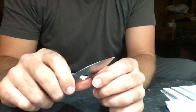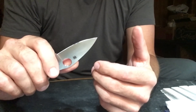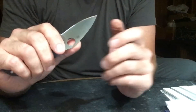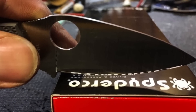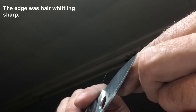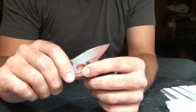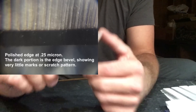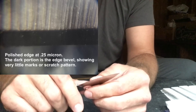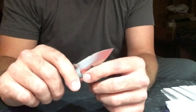I'm not using a guided system for this and I'm testing with the edge, so there can be an argument posed about the sharpening. But if you look at what I've done the grind is very tight, the polish is done very well, the consistency is there, and the knife was at 30° inclusive. In both cases I put the knife into an angle guide to make sure there was no variation in it. I also put the edges under a microscope — if there's any variation in your angle on the edge bevel, oftentimes it'll show up under the microscope, and in these cases there was nothing.